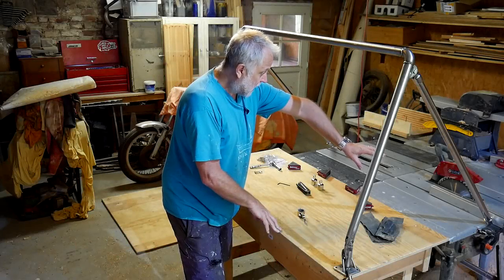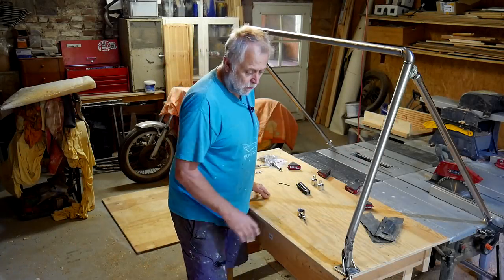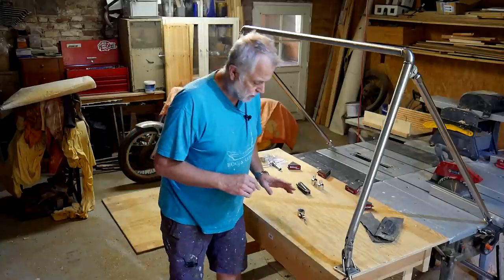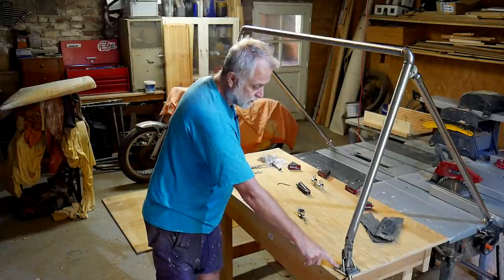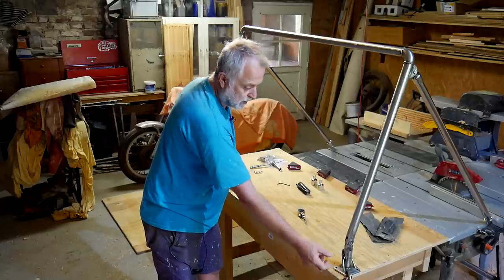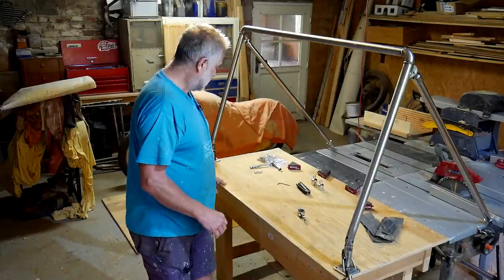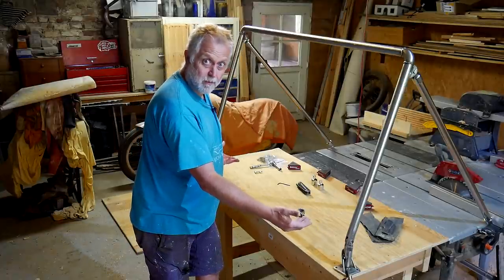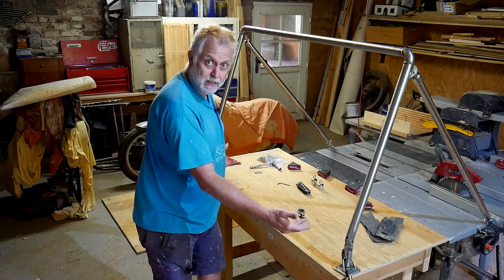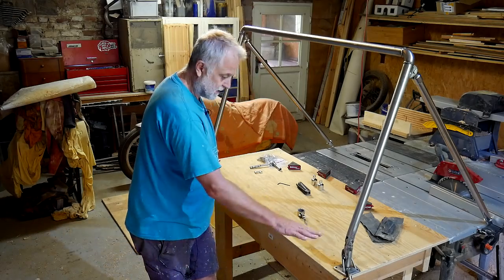The fittings for the aft end of those diagonal poles are on the deck installed. And one other thing that I wanted to do, because of the deck crown, these obviously don't fit flat onto the deck. So I made up a couple of little pads, a couple of little blocks that go under those feet, raise those up a little bit off the deck, which will certainly decrease any chance of leaking, and fair them up so that they sit level on the deck.